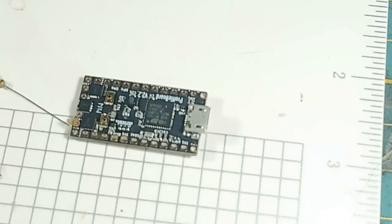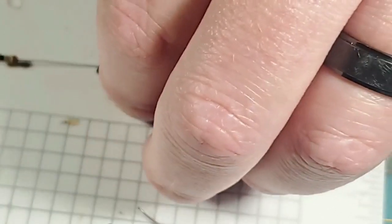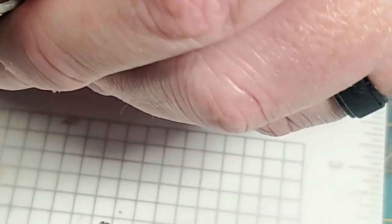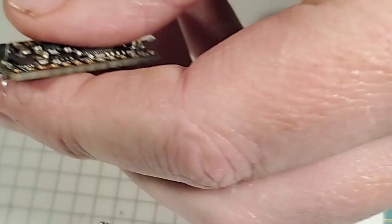Alright, so here we are. We're getting ready to install this Proffieboard on this DV6, and I'm going to start by putting my jumper on LED pads 2 and 3. If y'all seen any of my videos, you've seen me do this before. This isn't anything new. Basically what I'm doing is I'm taking resistor tail, and you don't need to use resistor tail, you can just use the wire to bridge the pads, but I like using the resistor tail because it makes sure that I've got good contact on both pads, but my wire is also going to cross both pads too, so it's almost like redundancy to make sure that I'm getting contact with both MOSFETs.